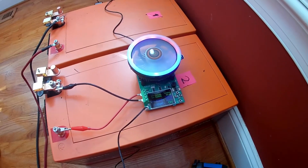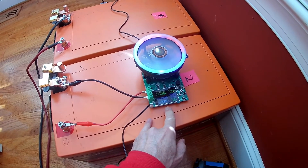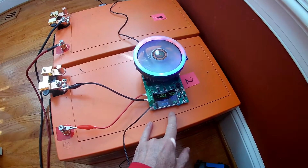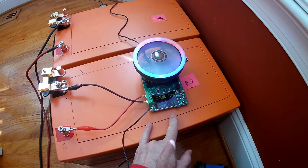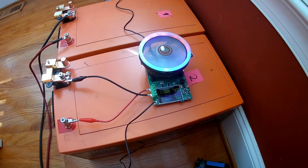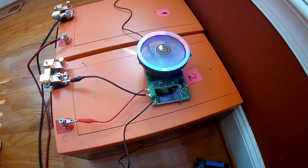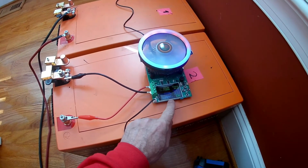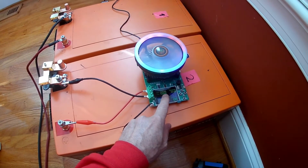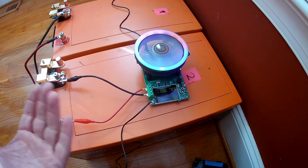Don't be obsessed with the voltage. As soon as I plugged in this meter, the voltage quickly dropped to about 13.1 or so. But the main usage is between 13.1 and 12.5. After 12.5, when you are at 270 amps — meaning you're down to the last 10% — voltage starts dropping pretty quickly. Meaning there's no real benefit of going past 90% capacity.